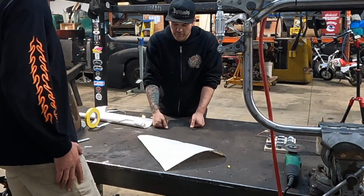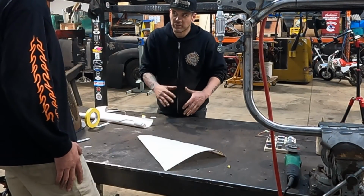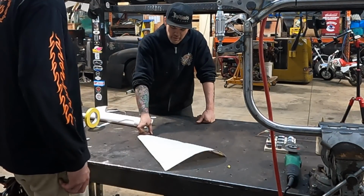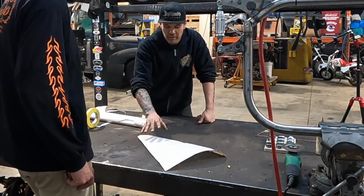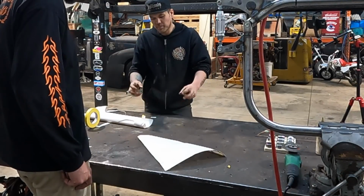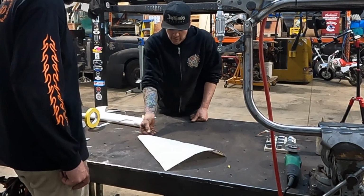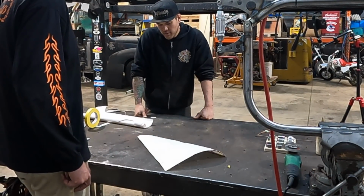And pull it out and not go any farther, because the rest of it you'll be able to relax with either the planishing hammer or whatever. Right. So if you were to shrink, you would probably end up shrinking just a little bit right here. If you were to do it all stretch, you'd probably only be really stretching here. This is all going to be form. That's the only real shape that panel truly has, other than when we tip this edge, we'll probably have to stretch the edge a little bit to get the flange where you want it. To get the flange, yeah.